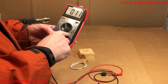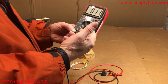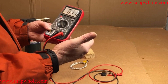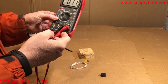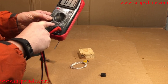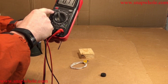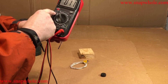180 degrees off on a temperature might be relevant if I'm using it to gauge when to quench steel, but I can use it, figure out if it's high or low based on the results I get, and I'm okay with that. I think this is a very useful tool. It was kind of expensive for Harbor Freight considering they give away free ones. This one cost $18 with a 20% off coupon, but it does more — it does temperature, which is what I need. The hertz function I thought I could use, but when I researched it, it's only for house voltage — not for true RF.